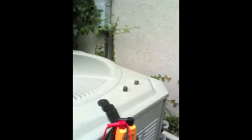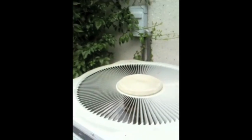This is a Trane unit in a three-bedroom house. It looks okay out here, but it's just not cooling. I think it's low on Freon — I don't see any signs of obvious leaks though, so we'll take a look around. It's a decent installation, except that disconnect box is not to code — it's too close to the condenser, there isn't enough clearance, and they have this big tree here. This is the kind of stuff you run into all the time.